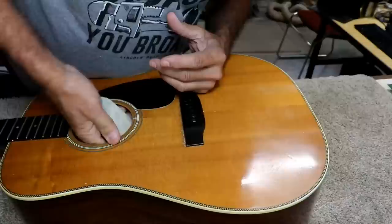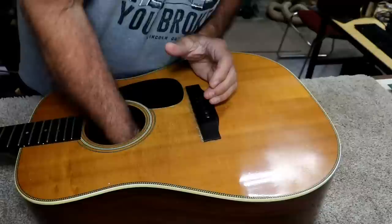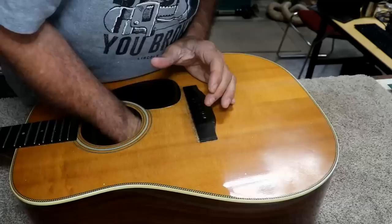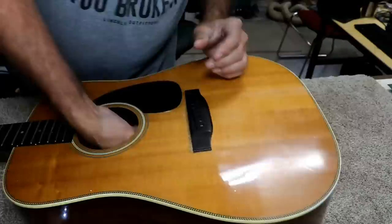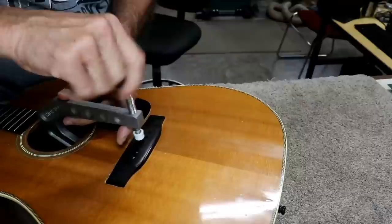What I think I'm going to do is put the glue on this really good, press it up in there, maybe even press it with the caul and take it right back out, then look in there and make sure the glue's getting good coverage — because you only get one shot at this. I've got the glued-up bridge pad in there just temporarily, pulling it back and sticking it in again, pumping it back and forth. Looking inside to see how much glue has transferred — that's real important at this stage. It looks pretty good but there are places not getting that much coverage, so I'm going to squirt a little more glue on here. I think it's the malformation of the top making it not contact fully, since this is nice and flat but the top is bowed a little bit.